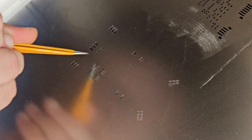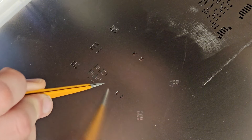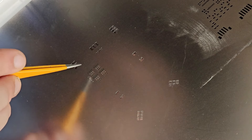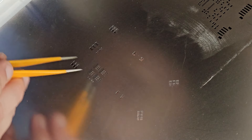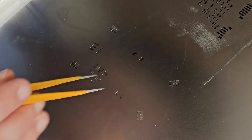Just like before, I have the paste stencil set up with the PCB nicely tucked cozy under its stainless steel shell. You'll notice these cutouts here for the Alpha and Omega 6144s are showing a little bit of green and I'm not quite sure why — the stencil is lined up correct to the PCB as it should be, but there is a little bit of green showing through. I'm not sure if these cutouts are exactly correct for this footprint, but for this type of footprint it'll be just fine — this is just the prototyping world, everything is fine, we can fix anything. There are no gaps — you can push on it and see there's no flexing, so it is against the PCB. In the prototyping world, these are just happy little accidents until your boss finds out.